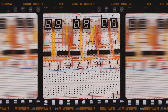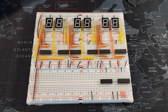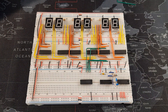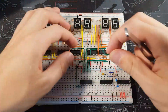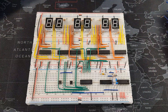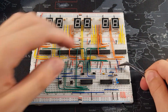We're going to interrupt this very important broadcast for a short word from our sponsor - it's me. Well, actually my dad paid for a lot of the components. Anyway, back to the video. We then plug two ICs into the circuit; these are responsible for bringing the 32 kilohertz output from the crystal oscillator down to eventually one hertz. We then put our final IC in, connect two diodes up to it, and two buttons along with two resistors. These two buttons control the minutes and hours - you only use them when you need to set the time. After finishing off the last of the wiring, our clock is completed.